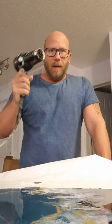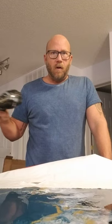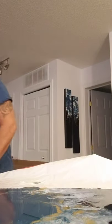If you find your tape is too sticky and you didn't do the t-shirt test or the towel prep yesterday, grab your hair dryer. If you try to remove the tape too quickly it may damage the wood and peel back some of the wood. So take your hair dryer and lightly run it over the tape for about 20 seconds or so — it'll reactivate the glue of the tape and you'll be able to pull that tape off fairly easily, a lot easier than without doing that.